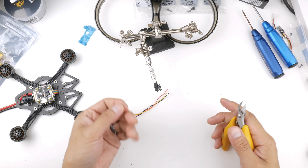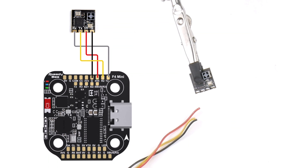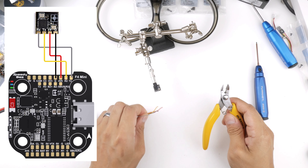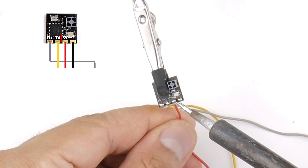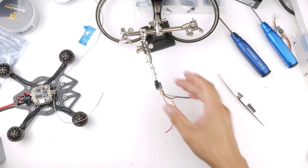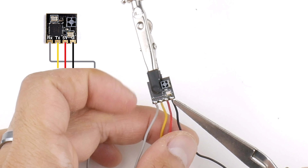For wiring up the EP2 I'm using four wires soldered onto the pads. The pads in order are RX, TX, 5V, and ground. I'm using grey for RX, yellow for TX, black for ground, and red for 5V. The wires are soldered on — double checking: grey is RX, yellow is TX, red is 5V, and black is ground.